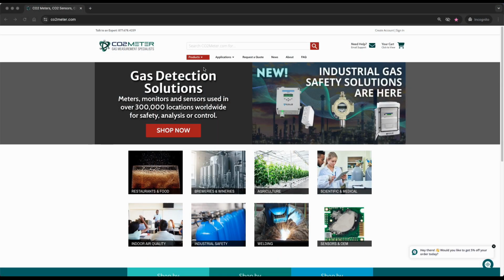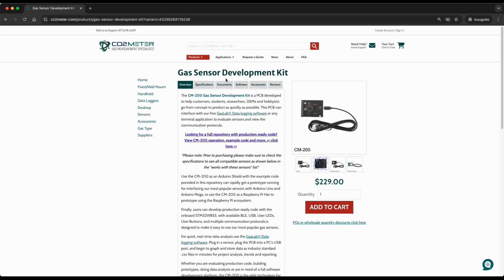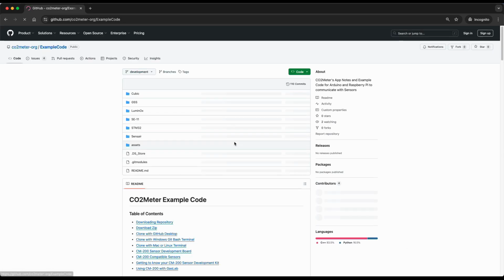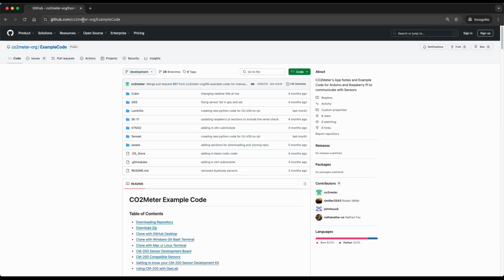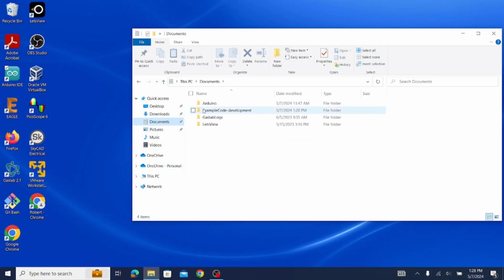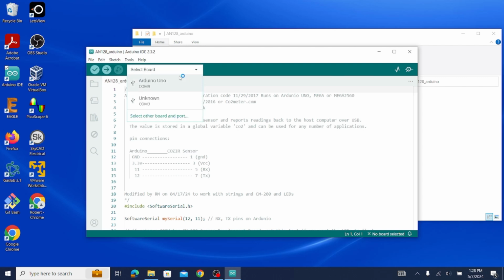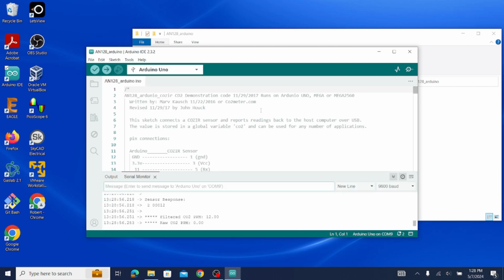To download example code and learn more about the CM200, find our GitHub repository link in the description of the product page on CO2Meter.com. Once you have Arduino open, choose Arduino Uno in the drop-down and click the arrow button. Your sensor will begin showing readings.